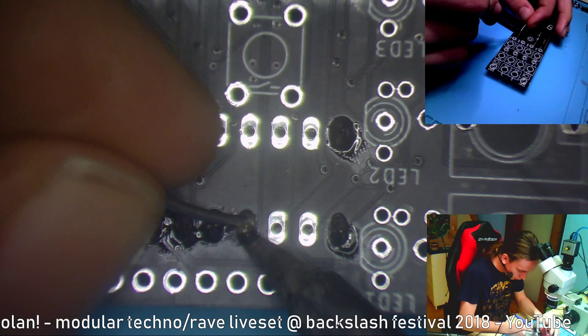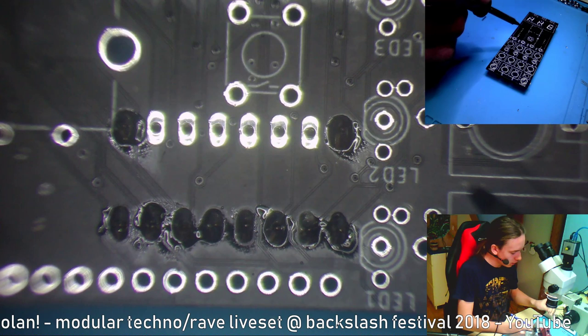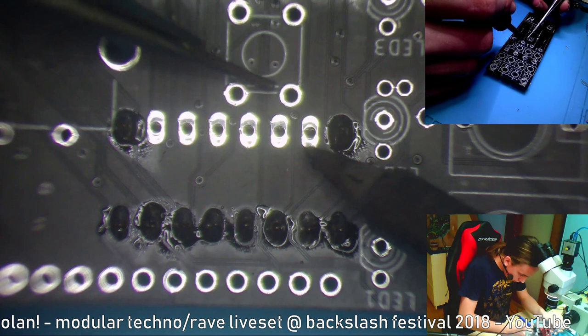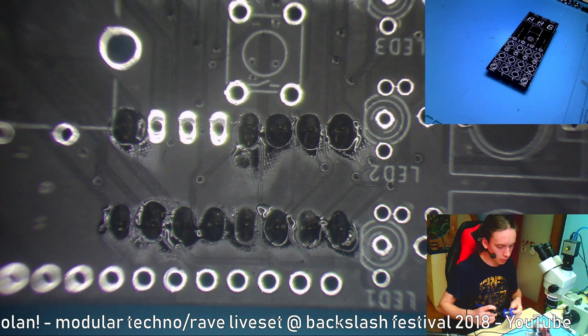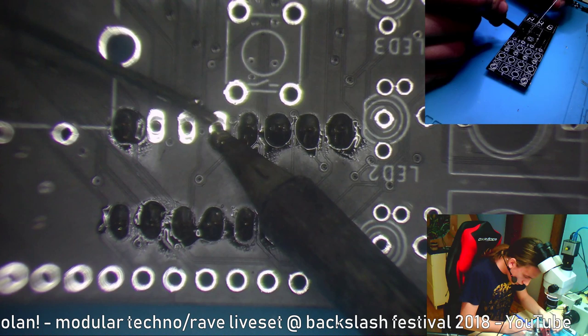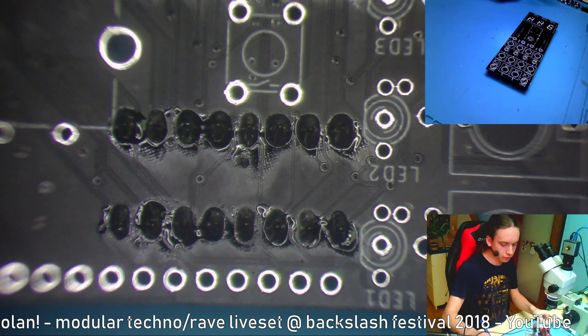If you want my clock divider that also has logic inputs, when you unplug the clock input it switches to logic mode, and you've got some logic gates: AND, OR, XOR, NAND, NOR, XNOR, and then two NOT gates that negate the signal coming into A and B. So 8 logic gates in total. It can divide by standard numbers, and it can also divide by prime numbers. I think it goes up to 1 or 2 kilohertz.